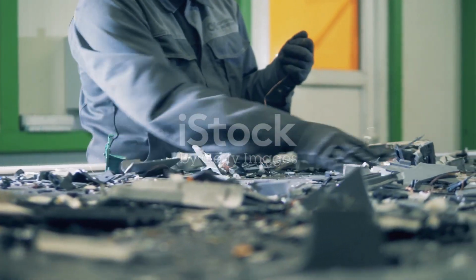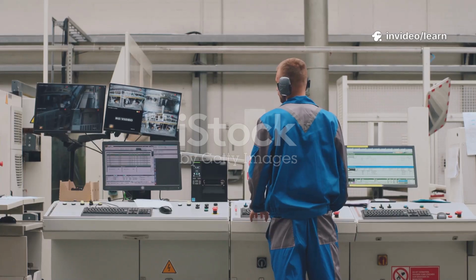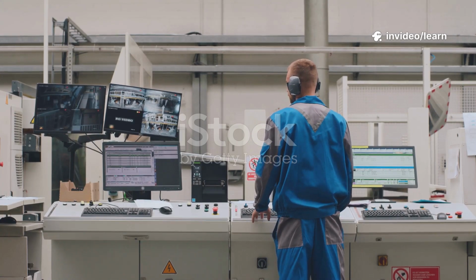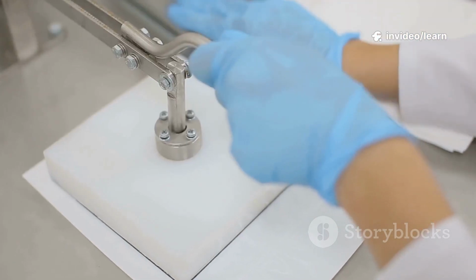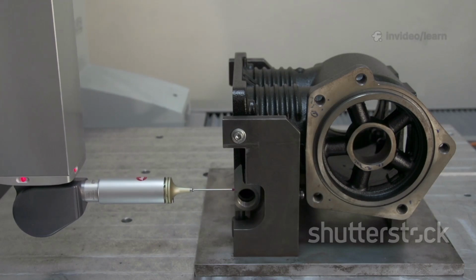During trial runs, you build a small pilot lot, maybe 30 to 300 parts. The goal isn't inventory, it's to prove your process is stable and capable. Every part is valuable data, carefully tracked and labeled. Focus is on key product characteristics, features that impact safety, fit, or function.